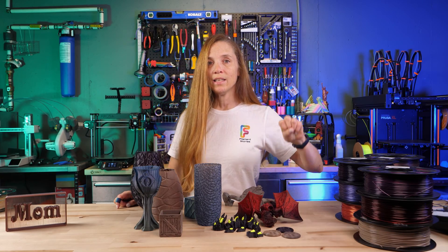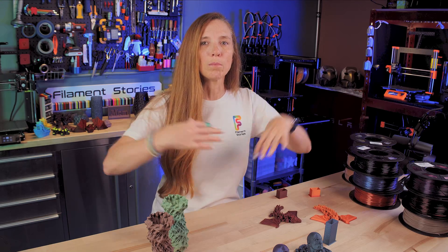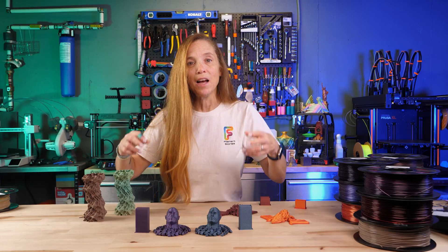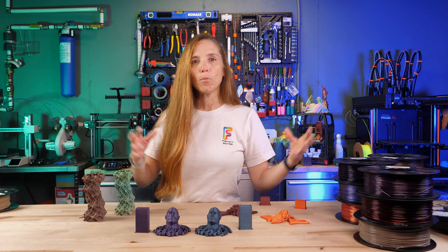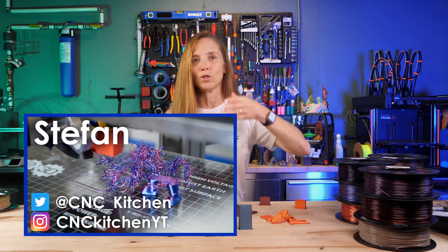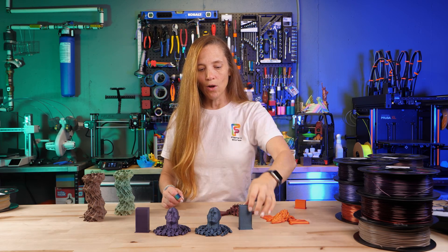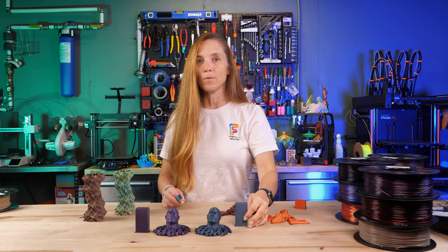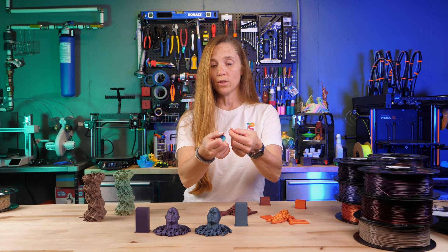So, is it stronger? The strength and the weakness are two sides of the same coin. Is the filament blending together, and are we getting the strength of the PETG with the PLA, or is it not combining? I said in a recent video that it was sort of merging, but the filament itself isn't merging. I'm going to send you to a CNC Kitchen video that shows how for co-extrusion and tri-extrusion filament as it went through the nozzle, it's coming out in the same orientation. That's true for this filament as well — it goes in with a core of PETG, and it comes out and is actually laid down in the model with that same core of PETG.